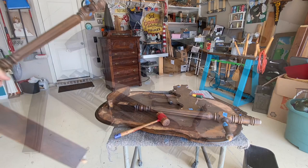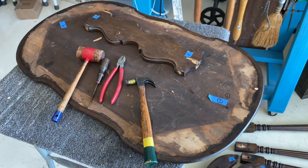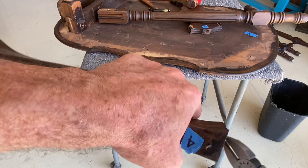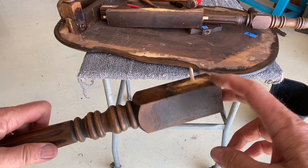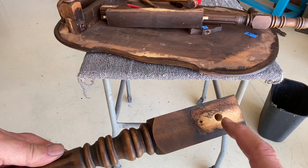Well, there's my jigsaw puzzle — my work for the next couple of days. Am I in too deep? I think somebody came along after and put these nails in; they just don't seem to fit with the general design of the piece. I'll wrassle them all out of there. Interestingly, I broke off some of the dowels. Looking at the top of the leg, you can see the other side of the broken dowel down in the hole. These were through-drilled, so it should be pretty easy to clean them out — just drill from this side to push out the old piece.